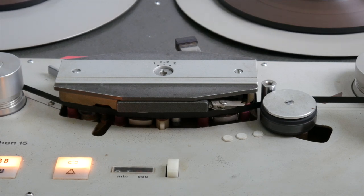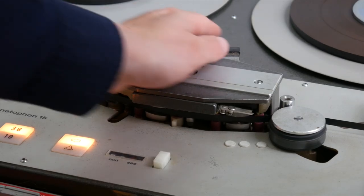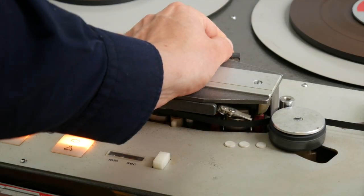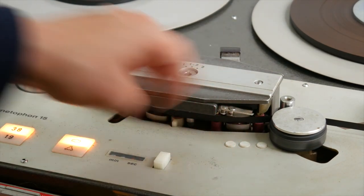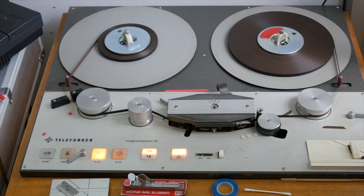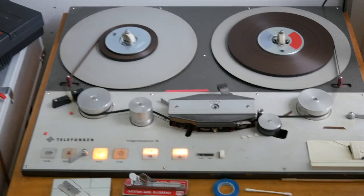All the frequencies are tuned like a piano. And for example, when I record at the lower speed, because at the lower speed the preamps have to work harder and they drive the tape harder, so you actually get a tape sound, because in the higher speed mode it's not really noticeable. You don't get much of a saturation. It just sounds nicer, but not tape exciting. So I often record at lower speed if I want more excitement, because the preamps work harder and I had it adjusted so there's more bass coming in through then.